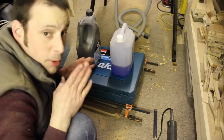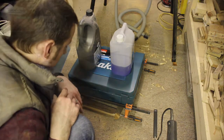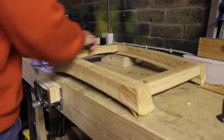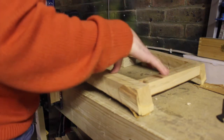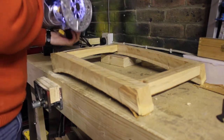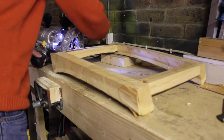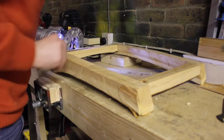Because of the curves it's starting to pop up, so I've just weighed it down with some stuff. Now that we have the frame all glued up, we need to cut the rabbet for the Perspex and the picture to go into, and the hardboard back. I'm setting my router up with a straight cutting bit, dropped by 8mm which gives plenty of room for the picture, backing, and Perspex. Now we're going to start cutting.